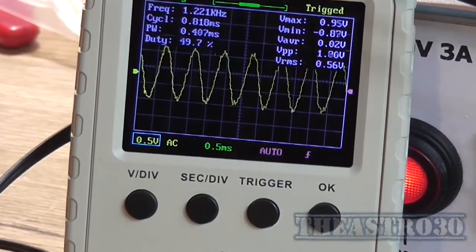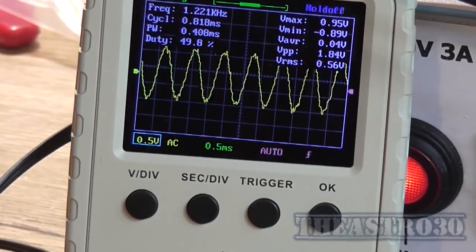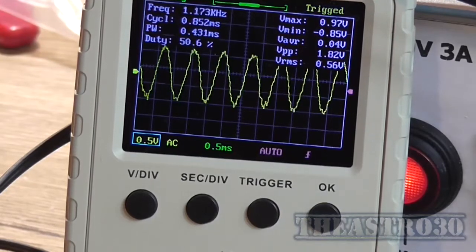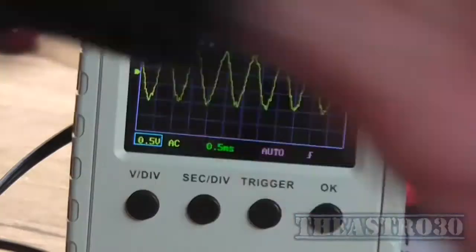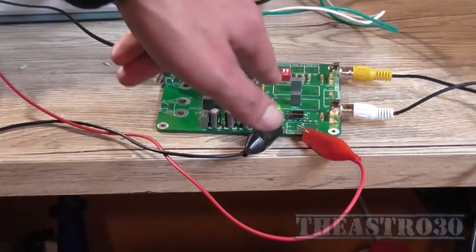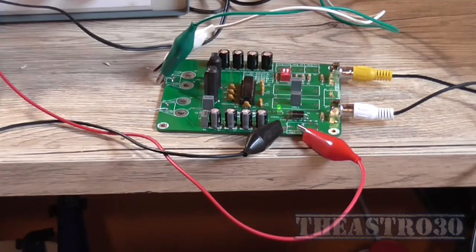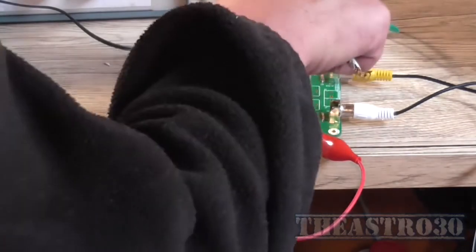Okay. Sounded alright. It does sound a little bit buzzy. I should really check the operation of the other channel now, because I'm only plugged into one speaker, obviously. However, that IC is getting pretty hot, so you'd probably want to epoxy a heatsink onto that IC to dissipate some of the heat, because even Class D amplifiers require heatsinking. I don't care what anyone says, but they do.